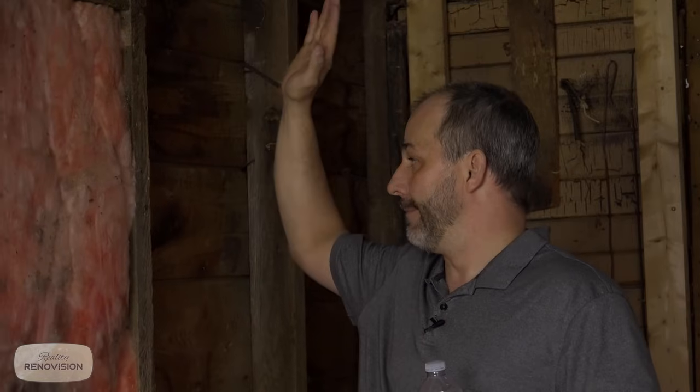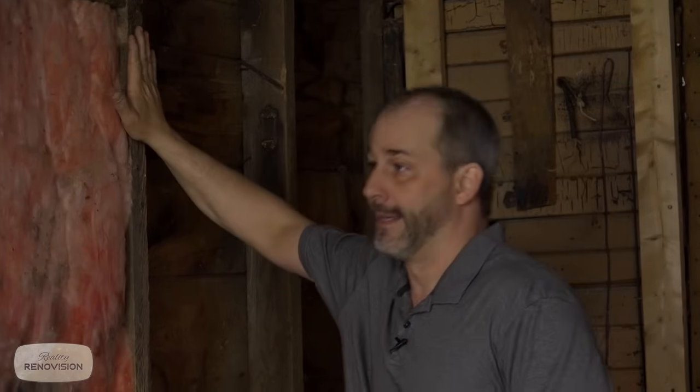So when you're thinking of renovating an old space, you might want to do what I'm doing here, which is, one, some aspects of this room I'm not making any smaller. I'm actually going to laminate 2x4s on the side and add a little bit more insulation than a vapor barrier. And I'll follow a little bit of that curve, and it's not really a big issue. If it's just drywall and that's it, not an issue.